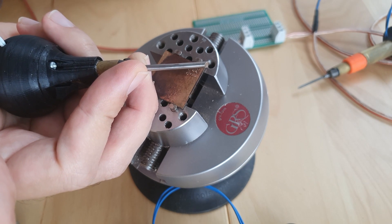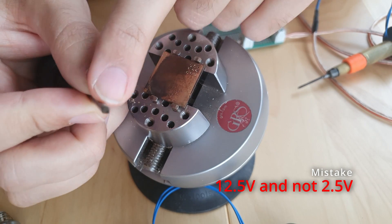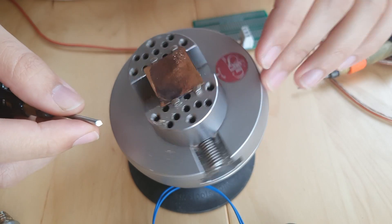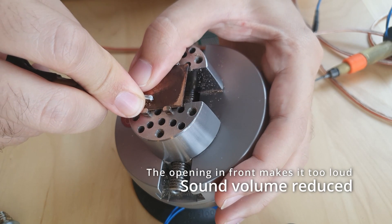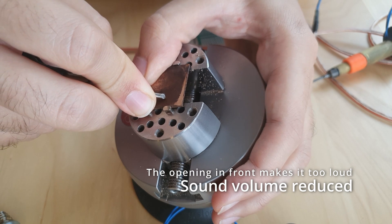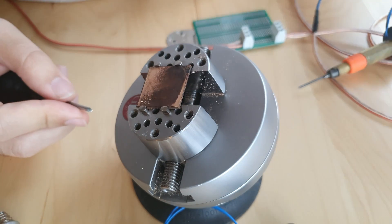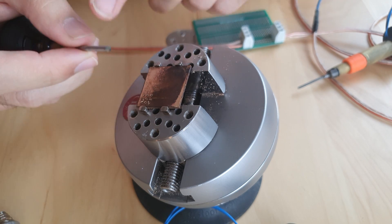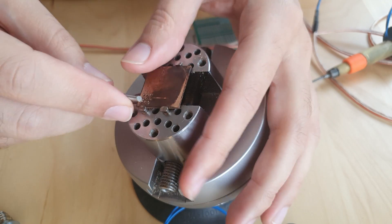This is the voltage that's okay according to my measurements — it's reaching about 2.5 volts, which I believe is enough. This is a 120-degree graver that I oxidized to make it easier to see. Let's start just a bit, and then I'll increase to 15 volts — it's going to be super heavy. I'm using a carbide graver here and trying to go deeper.